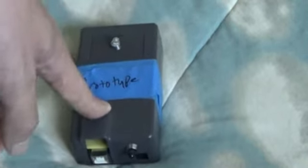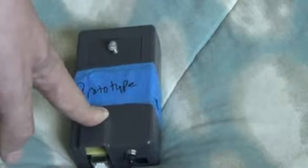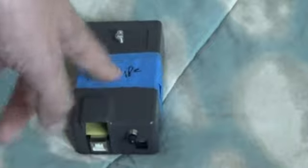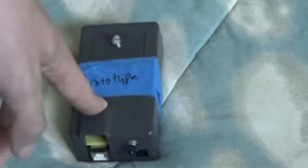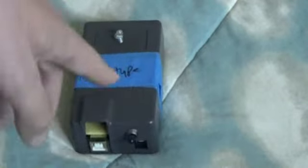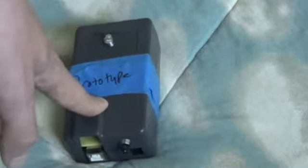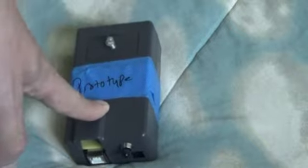But then there's the issue of, well, wouldn't it get reported twice if it takes you two times? Well, I thought of that, so I actually have a parity checker in there that for each hit, it has a unique ID, a hit count ID that sends. So that way, if it sends duplicate requests, it won't re-record the hit. It still only records it once.